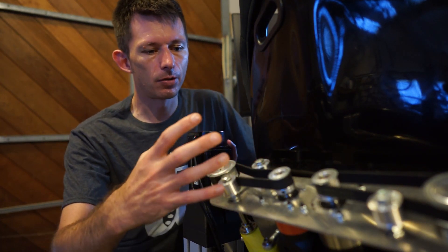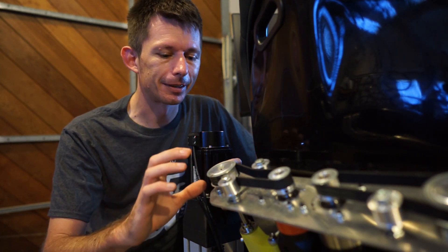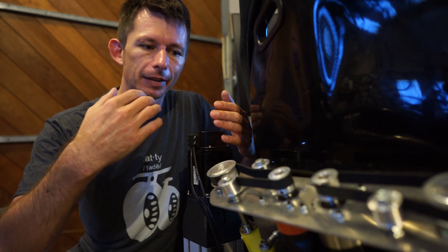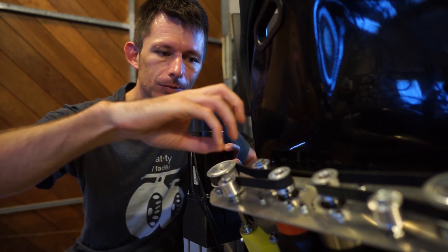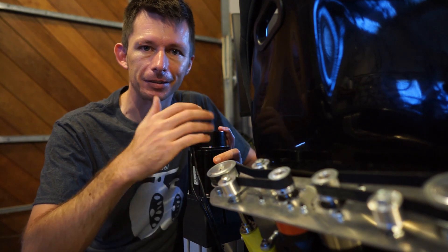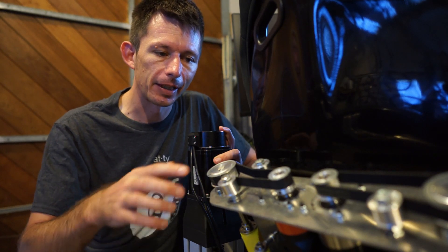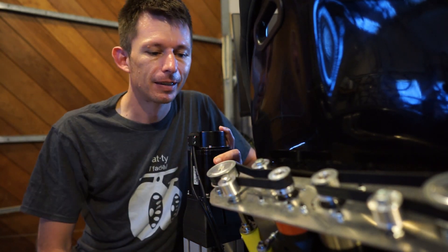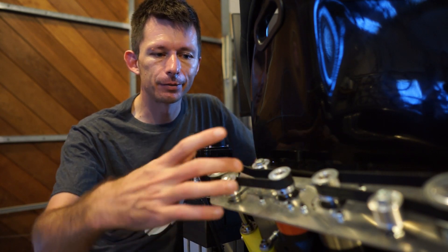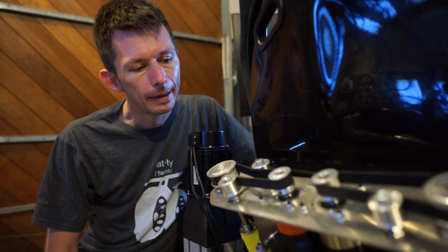These belt pulley systems just are not strong enough. They're a 3mm pitch, 16mm belt — they really don't work. What's happening is the belt, when under load, is actually expanding slightly, and then the pinion pulley slips inside, makes a horrible snapping sound, offsets by a couple of degrees, and you lose the effect on the seat. In a couple of weeks, I'll have some new 5mm pitch, 27mm units, which are going to be big and solid. Hopefully that solves the problem. Otherwise, I will adopt something like Berry's design with a lever arm setup. I want to stick with belts because they kind of look cool.